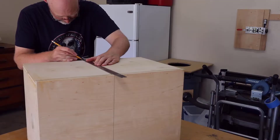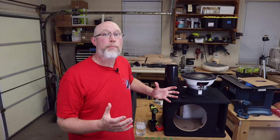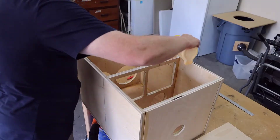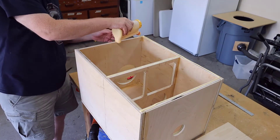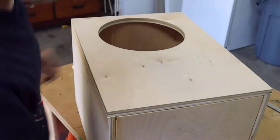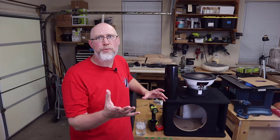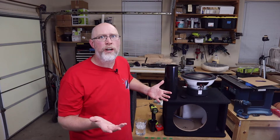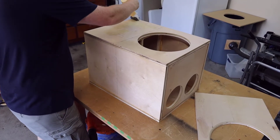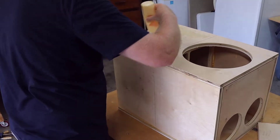Since I know that it's nice and square, I can go ahead and scribe a line on the outside of the enclosure so I know exactly where I need to drive my brad nails. Now it's time to attach the baffles — I've gotten into the habit of attaching these two separately. I'll put the first baffle down, make sure there's plenty of glue, and then brad nail that to the brace and the sides of the enclosure. Then I put the second baffle down. I recently picked up this glue bottle that has a roller on the end of it — so far it's the easiest way I've found to spread a large amount of glue over a large surface. I'll put a link in the description if you want to pick one up.